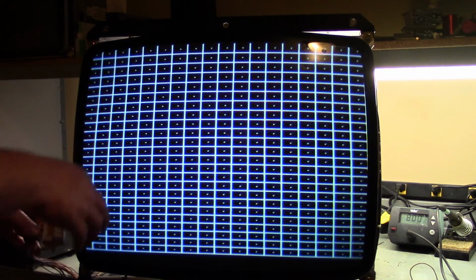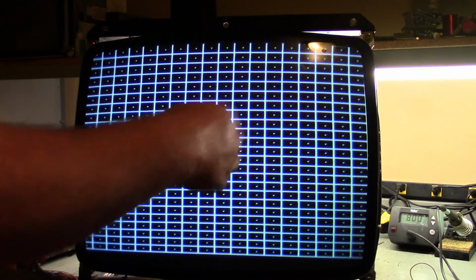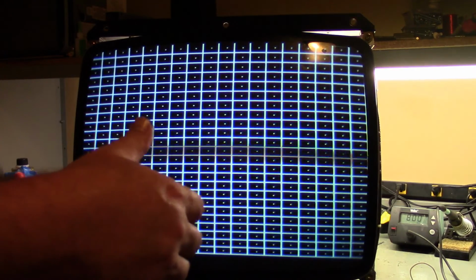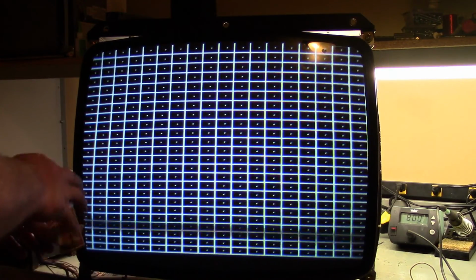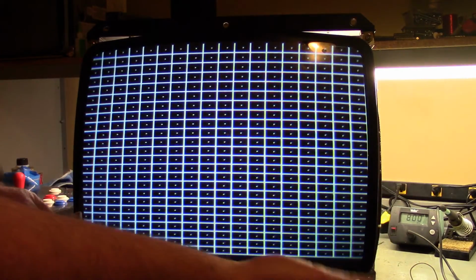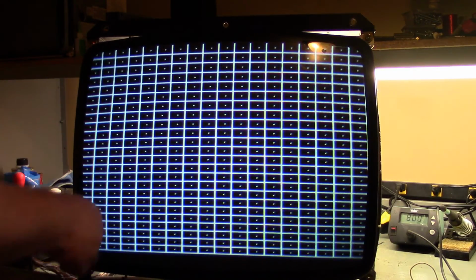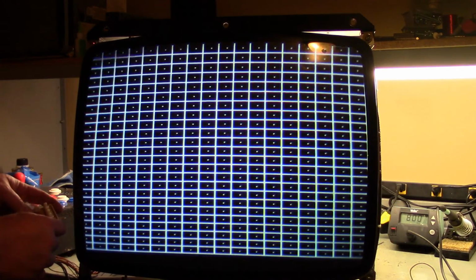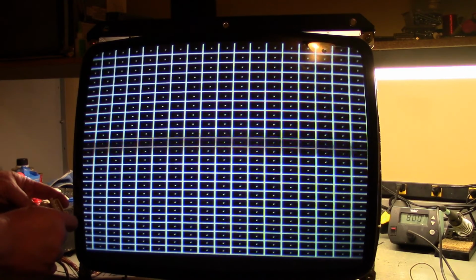Of course, all these settings are going to be different when you put an actual game on, because the test pattern generator kind of overdrives the signals. So if you set your brightness and contrast and everything per the test pattern generator signal, when you hook it up to a real board, it's going to be much darker. So I'm not really going to be too worried about that. But let's see if we can adjust our position and size to kind of at least fill the screen.